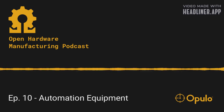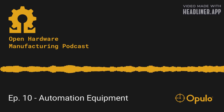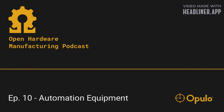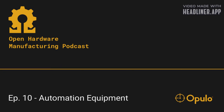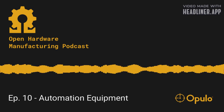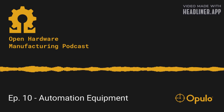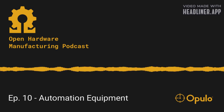It's worth saying that anytime we build a jig, it's almost a point to get in and get out as fast as we can. It's not something we refine to the point of being saleable. It's to perform the task and that's it. There doesn't have to be much documentation — we're still small. If we were a really big organization, it's worth spending that time. At Formlabs, a jig wasn't considered done unless there were assembly instructions, debugging instructions, and maintenance instructions. It was its own product, as documented as anything they had sold there. Bunny Huang has a great article series about making a test fixture — one of my favorite lines is that when you make a product, you actually make two products: the product and the product that tests the product.